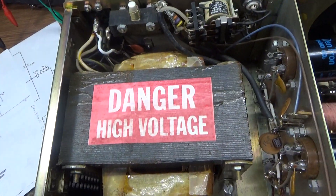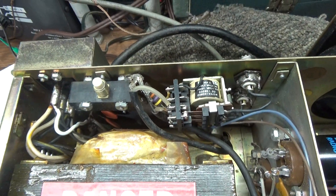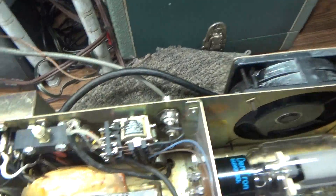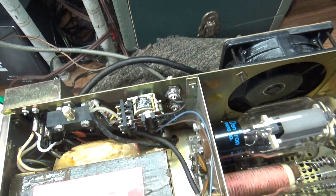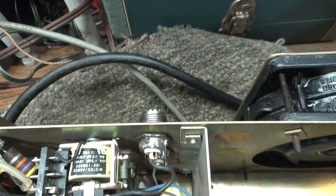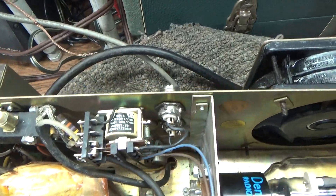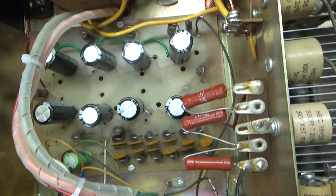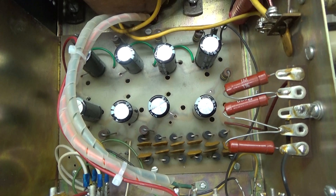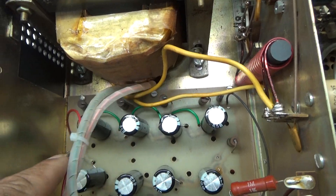Here's the inside of the amp — a very basic amp with a single power supply transformer. It has an interlock so removing the top cover disengages power, though that's been bypassed on this one. It's unplugged and drained. There's an RF relay for the input/output switching, which also grounds the grid for the tubes. The tubes operate on high voltage with the low voltage power supply circuitry here.